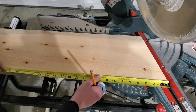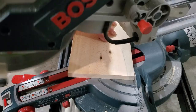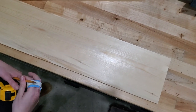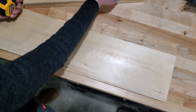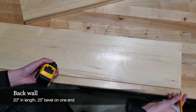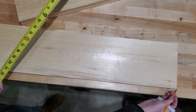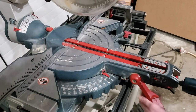We're off about half a centimeter. So now we're going to do the back side of the birdhouse. We want to make sure we're pitching the back of the board at the same degree — again, 25 degrees — so it's going to cut off a triangle piece like that. We want to measure again our 20 inches for the total length of the board. We make sure when we're cutting this angle that the tip of our saw starts here and goes down like that so we don't lose our total length of 20 inches. I'm setting the bevel of our saw to 25 degrees.